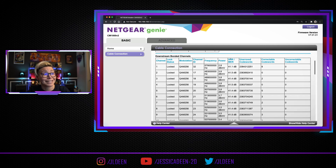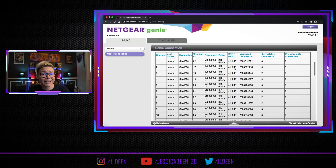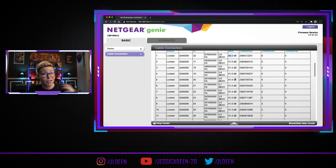The next thing to check is SNR — your signal-to-noise ratio. You want it ideally higher than 38. My professional opinion is to aim for somewhere between 40 and 44; you don't want it higher than 46 or 47. If you're seeing numbers in the low 30s, you don't want it lower than 36 — that's another indicator of a problem with signal strength going into the modem. Power and signal strength are both important.